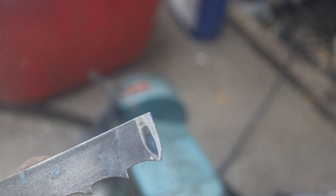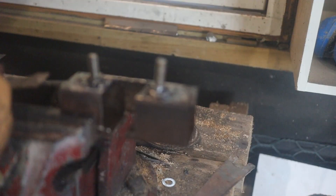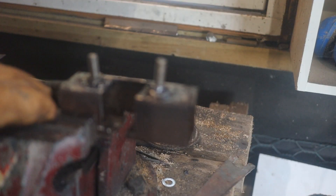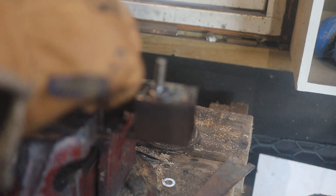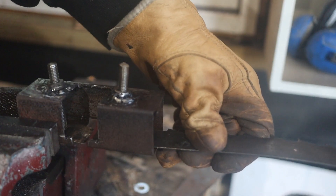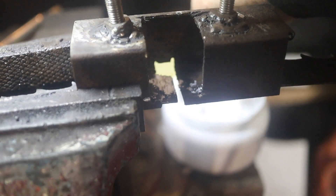Try to remove most of the oxide with a brush wheel. Then we thread the ends into our jig, clamp it in place with the rods, and give it a generous amount of flux and clamp it all in place.